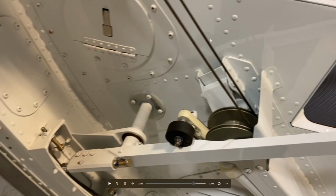And actually, when we land, if we're doing a quick turn, we're not going to repin the aircraft, but if we're shutting down for the day, one of the very first things we're going to do is pop out, make sure obviously the passengers are gone at this point, and we're going to pin the gear and the ADG, and make sure that the aircraft is chocked and those kind of things. And we're going to continue whatever we're going to do for the shutdown. But from here, I just wanted to point that out because that is something we use a lot.